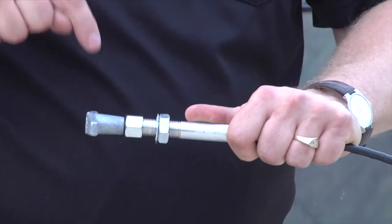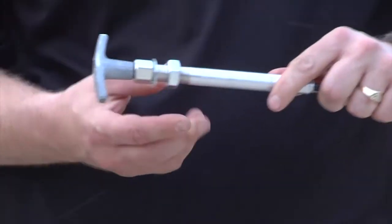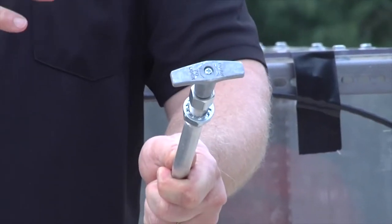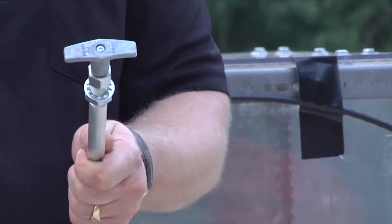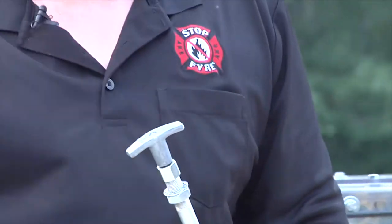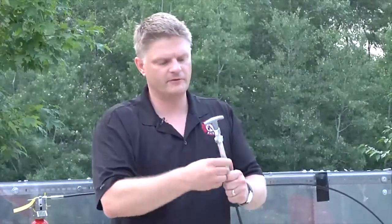Very few of them have a metal handle attached to this bulkhead fitting. What I would do is drill your hole, unscrew the metal handle, take it off, push that end through your firewall or wherever you want it to go through, then attach the handle on the other side. The key point with a metal handle is that plastic ones have been known to occasionally separate — can you imagine the plastic pulling free from the assembly and it not activating the extinguisher?